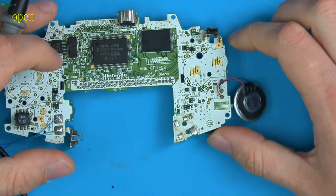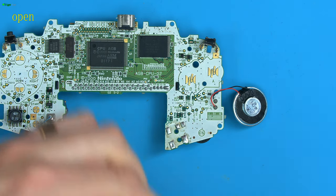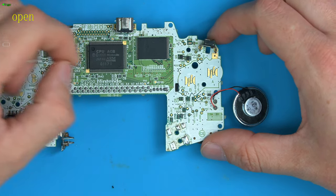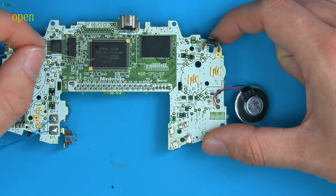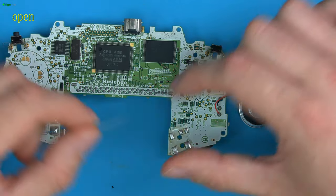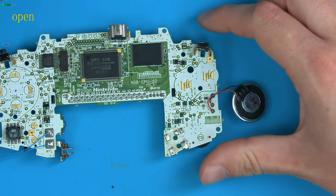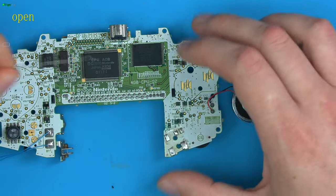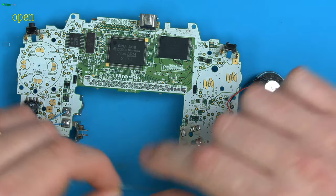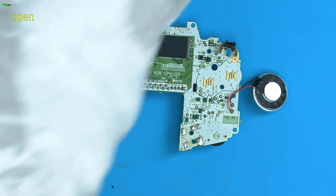So back to our board, we know that pin 5 is going to cause a problem if we don't ground it. So we could connect a headphone socket to here, but again, I don't want the video to be full of just replacing components that I know aren't really a problem as such. Similar to this rubber up here for the trigger. We could test that as well after, but for now we could just put a tweezers in and press the button. So when we can work around it just to get the board working first and solve the known problems, we'll do that. When we come to then restore this to use, we'd obviously put a headphone socket on. But let's just prove that's the problem first.